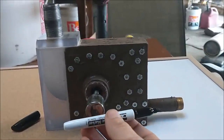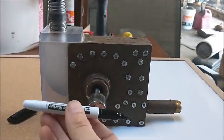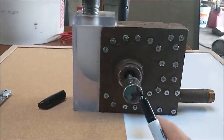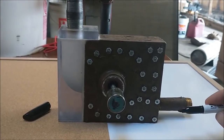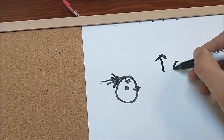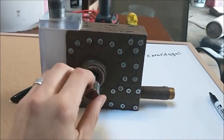The centrifugal head is a back pressure that goes the opposite way on the inlet. The fluid or gas is coming in with pressure, and there's an opposite pressure pushing back against the gas. But that opposite pressure doesn't happen until the rotor starts getting up to speed. That's why higher speeds are important — you start to produce that back pressure that prevents the fluid from going straight through the turbine. So we want to increase the centrifugal head. We increase the RPM the turbine runs at, and that produces more and more centrifugal head.